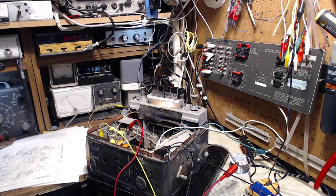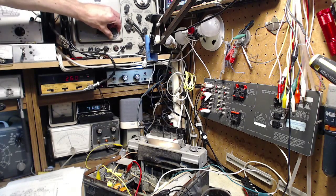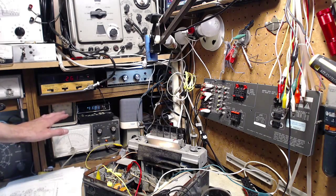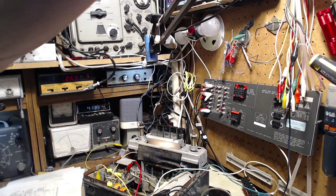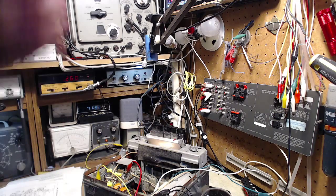So we'll tune my signal generator here and watch the meter, and when it's maximumed. I made up my own word there. There we are, and we read it, 261. That's pretty much 262. So what I'm going to do is leave it set there and try adjusting the IF transformers. It's a very, very small slot. I'm going to use a metal screwdriver, which you shouldn't do.